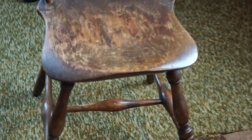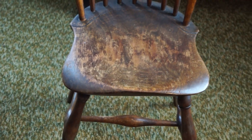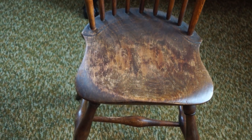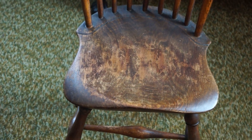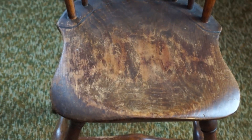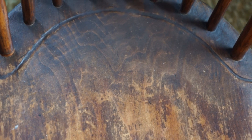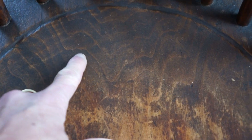What makes this chair unusual is the seat. The seat is made out of maple — it is not made out of softwood, which most Windsors were. Upon researching this chair in my Windsor book, there were some maple seats in the 1700s from Connecticut, and they only used flamed maple. And if you look here, you can see some of the flaming of the maple.